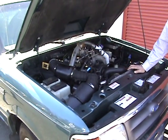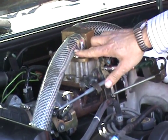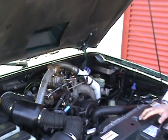As you can see, we've got tubes running over here. This is our air inlet during the time we're on wood gas, and this is our fuel line on wood gas. Typically it's a one-to-one air-to-fuel ratio at that point.